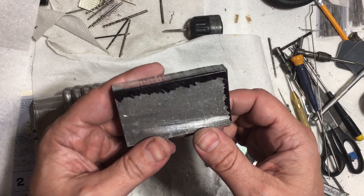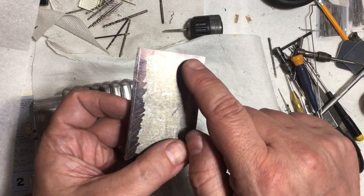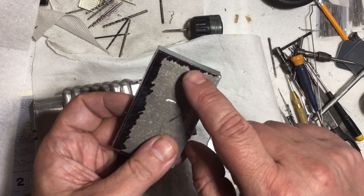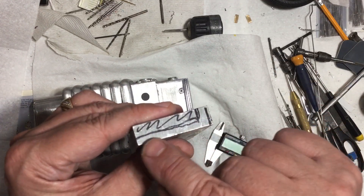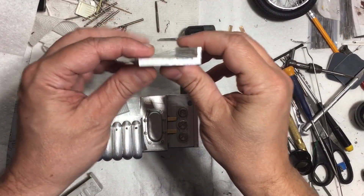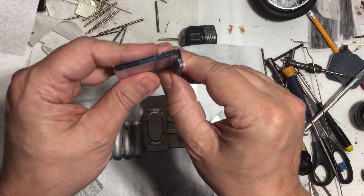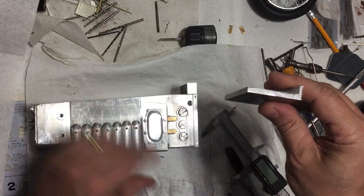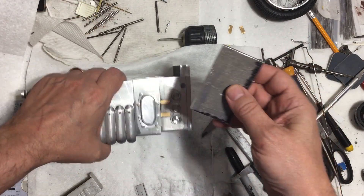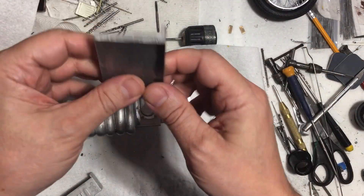There it is right off the band saw. I'm going to put it in the mill and I'm just going to end mill to the line - exact dimensions are not that critical. I'll end mill it to the line and then remove that section there. There's that piece off the mill - got all that material out, surface finish is good enough for what it is, and again this will sit in here like that. Now I need to mill in all the little grooves, so let's take that over to the milling machine and see how that comes out.